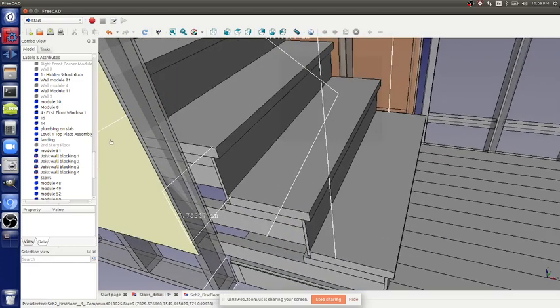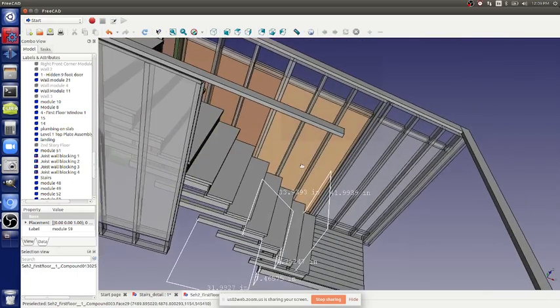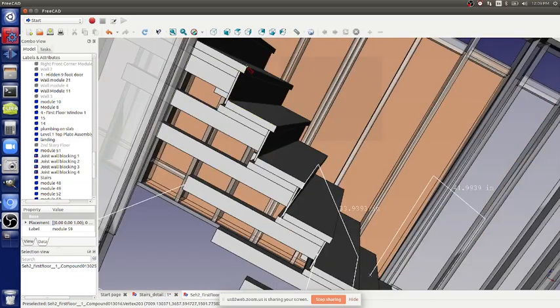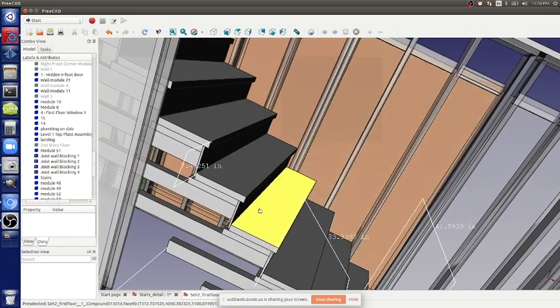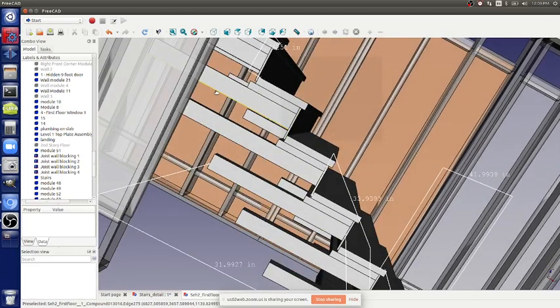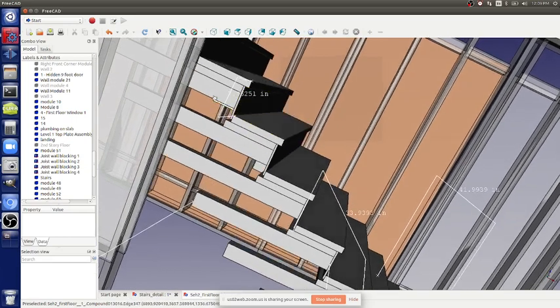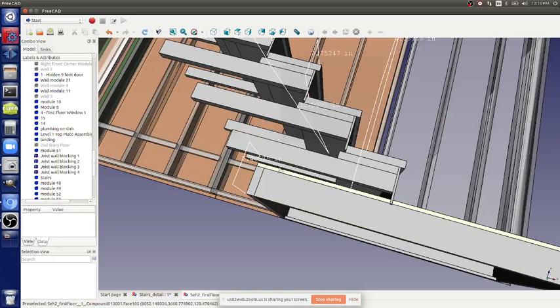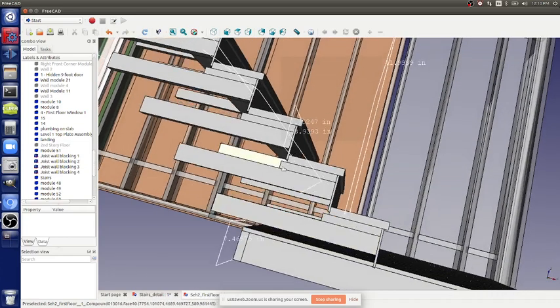So now, do we have, for real, 7.5 everywhere? That would be a good question to ask. Let's take a look. From here to there, 7 3/4, yes. So we're rising 7 3/4 everywhere, which means, what's the deal? The bottom of this thing right there to there, what should that be? That's the rise, right? Same. Yeah, let's measure that. So you've got 7.75 everywhere, except for the bottom, which is 7.5 off the floor, off the concrete. So that's where we're at.